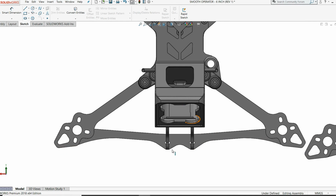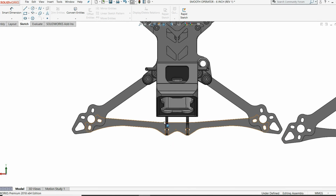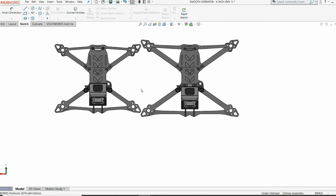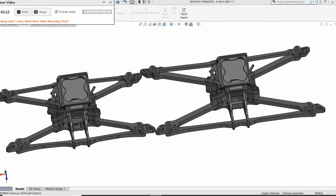But this is a line that runs across here. And so when you hit, it tends to want to distribute the loading across the entire face, the entire front. If you had this portion sticking out or you had the arms sticking out, it's just going to have that load running through these sections alone. It's better to distribute it across a larger section of material. And so that's the same method I've used here. So I've had to extend this front section out to keep this all on the same plane. All right, so that is something that has changed.